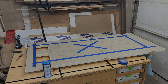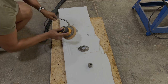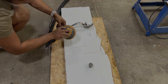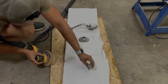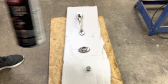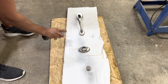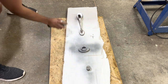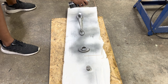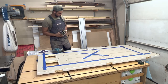This part had me really nervous, so I distracted myself by getting the hardware prepped. To get the hardware prepped, all I did was scuff it up with 150-grit sandpaper to make sure there was a nice rough surface for the paint to adhere to. I'm using an exterior-rated metallic aluminum spray paint, and I was honestly stunned at the difference this made. New hardware can run anywhere from $50 to over $100, and this spray paint was like $8. Super excited with how this came together. But now that that's done, we kind of have to cut the door.